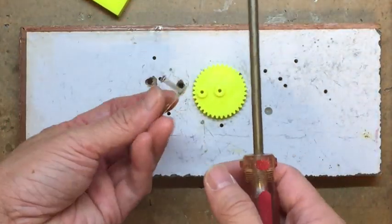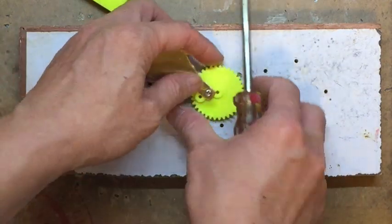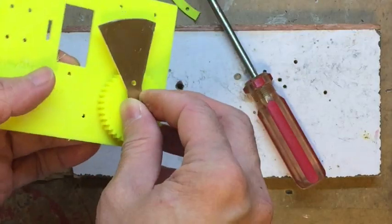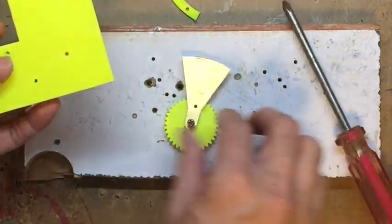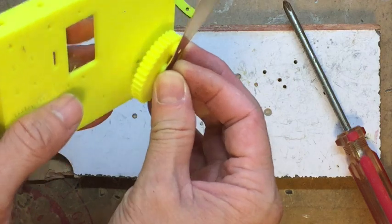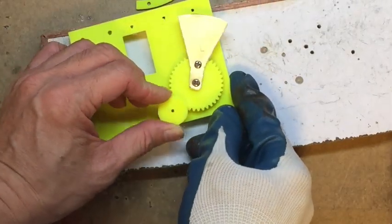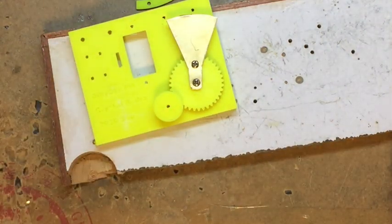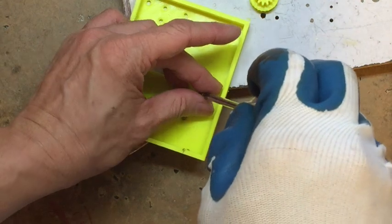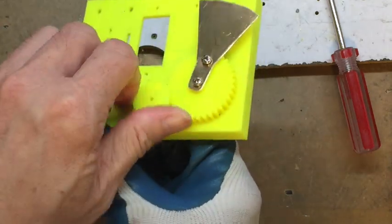So we have drilled the holes and now we need to mount it on the spur gear. Using the M3 screw, we can drill through the baseboard and put these rotating plates in the right place. We're almost done. We just need to install the second gear, which is the knob. You can use the M3 screws and drill through it from the bottom.